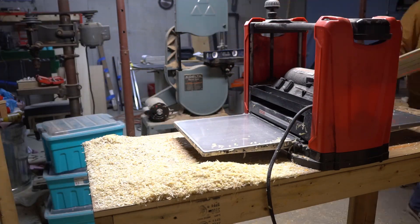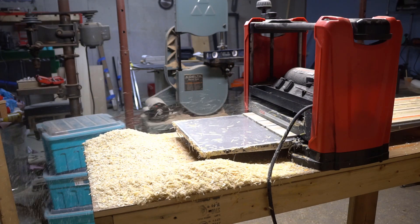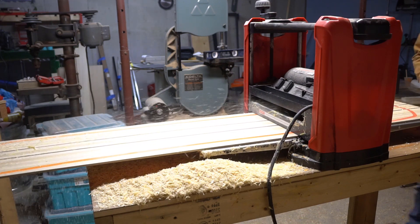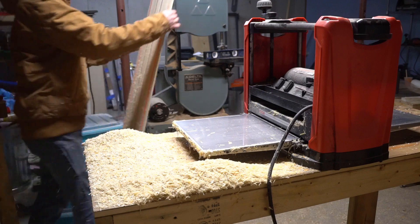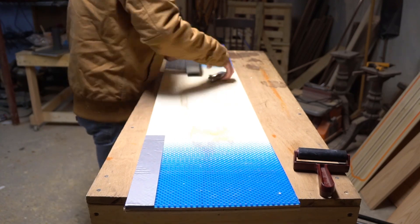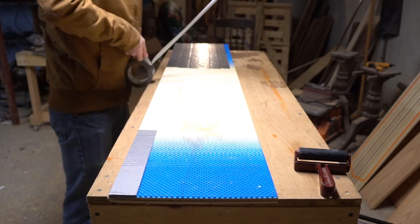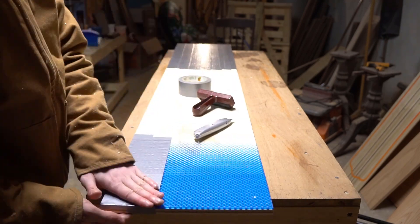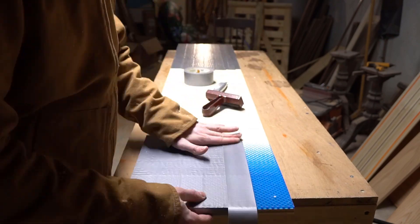Once my urethane was cured, I needed to plane the core back down to the proper thickness — this also has the added benefit of getting rid of the wood at the bottom of the urethane channels. Once it was the right thickness, it's on to profiling. Last time I used a 3D-printed cradle and had some issues with tearing out and shattering — some of that was due to the length of the core, so this time I left a lot of extra material at the nose and tail outside my sidewall channels to account for planer sniping. I also got great tips from you guys about fastening the core blank down more firmly, so I used the most high-tech of solutions: duct tape.